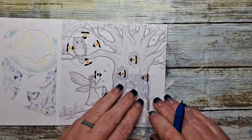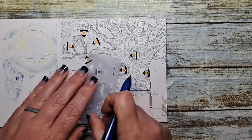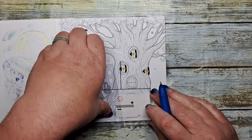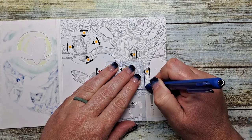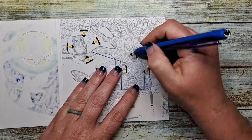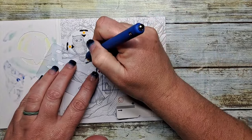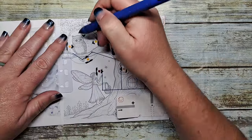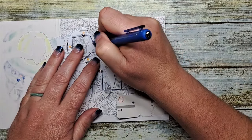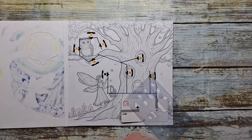Now we're going to connect all of the negative aspects of our stickers. I'm going to use my blue pen to show the negative line and I'm going to connect all of those stickers to the same circuit. They do not have to be in a straight line — you can have multiple strips or multiple parts of your circuit come off one line. I'm just figuring out the best way to connect all of my stickers together. We're going to go up into that moon and connect the four stickers up there. I try to make the lines that cross my sticker straight — the contact is just a little bit better when your circuit is straight. And there we go, there's the negative side.